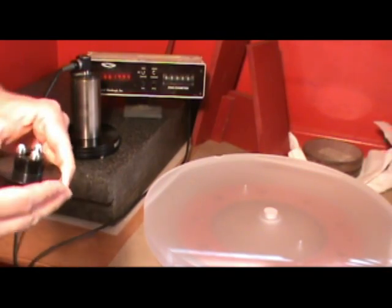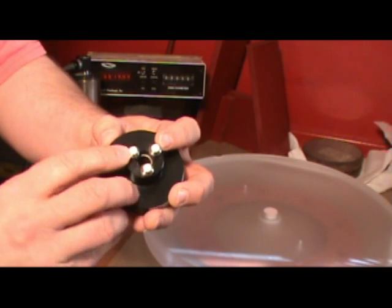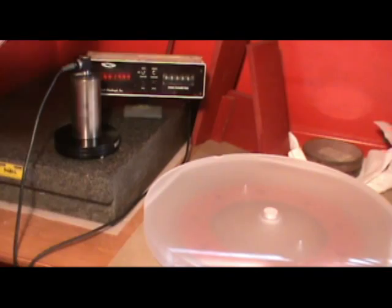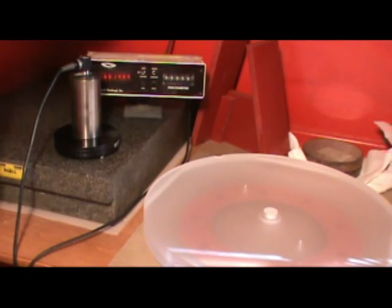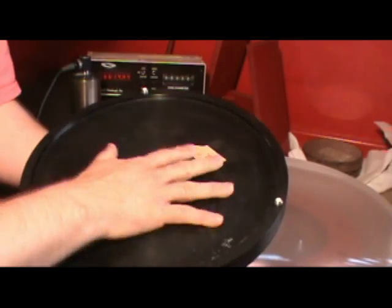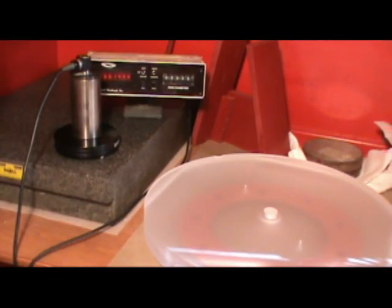For example, if I'm doing lens work, I can have tiny little plates like this — you can see the three balls are very small on this one. And then I may have a need for a slightly bigger plate. This is an eight-inch plate, as opposed to the five-inch that I just had. So if I'm using a little bigger mirror, that's the plate. This is a 12-inch plate — you can see the size of this, it's getting pretty large, so it's six inches from the balls in. And I've got plates all the way up to a 16-inch plate for the largest ring that I can put on this spherometer.